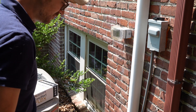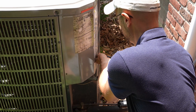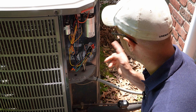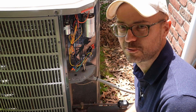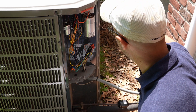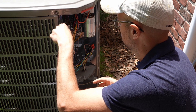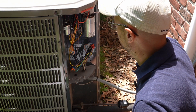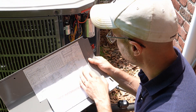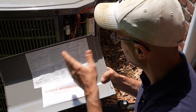Okay, power's now cut off. Now let's see what we've got inside this panel. So the first thing I'm seeing is a couple of capacitors. And what's the first thing we do when we see capacitors? That's right - discharge them. So take a screwdriver, make sure it's insulated, and just run it across those terminals. Make sure you got them. Those are discharged. And then on the back of this panel cover is a schematic of the whole system that we can reference. It's a good idea to familiarize yourself with the schematic before working on anything, especially a system like this.